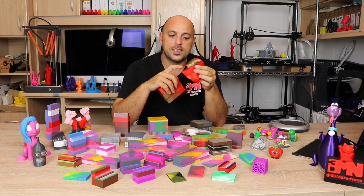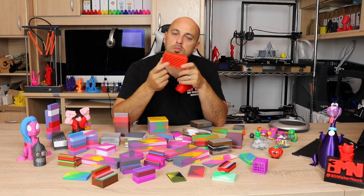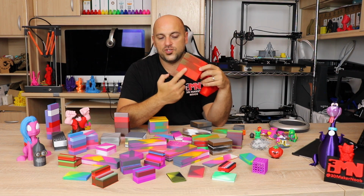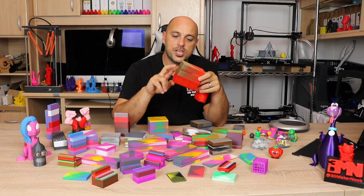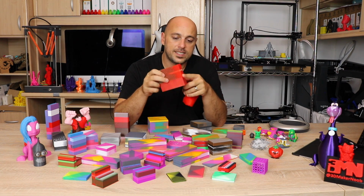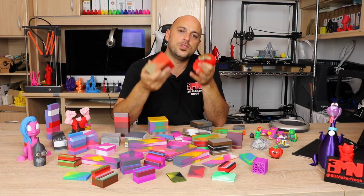And the reason for that is that not all layers have a color change. So when there is no color change, the infill becomes almost 0. It's actually about 4 or 5%. It's just there to hold the structure. As you can see from the side, it is just red at the bottom and the color transitions go up. When you have 2 color changes, it turns into about 50%. When you have 3 color changes, it goes to about 75% infill. So it tries to minimize the waste by itself. Obviously, once again, once you calibrate the printer, you can actually reduce that waste even more.